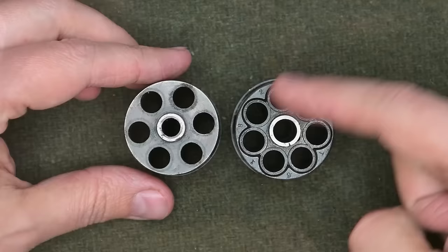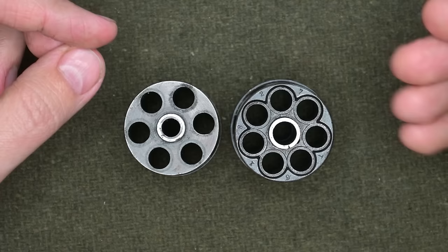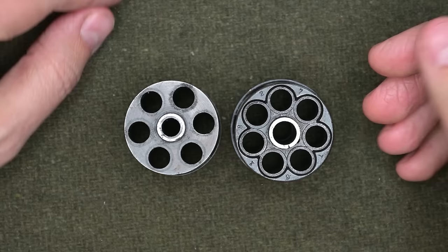At the front of the cylinder, we see more differences. Very beautifully, all 7 chambers have been recessed somewhat so that this will overlap the back of the barrel slightly, to help with obturation. I've been told the depth of this was increased in order to make the gun operate more reliably with fouling, although I'm not really sure what they were running into to cause that problem, given that it was supposed to seal to begin with.